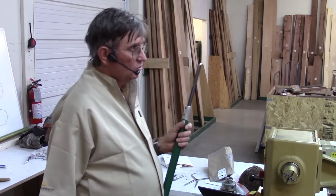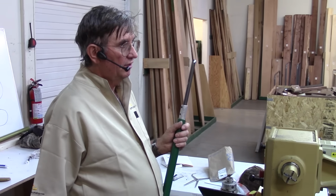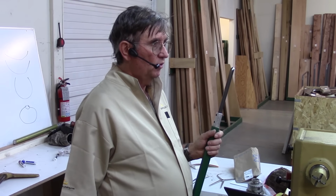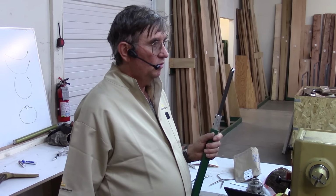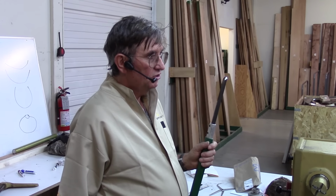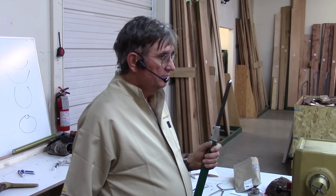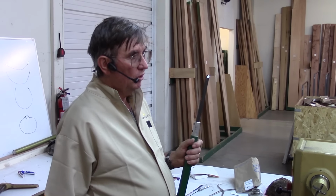David Ellsworth's, the one that he likes to use, is 180 grit. I know some of them go up to 400 grit, and he says that's too fine. You don't get the burr that you want. But what I do know is when I went back to my lathe and started turning after using that sharpening system, I had never cut with that sharp of a tool before.